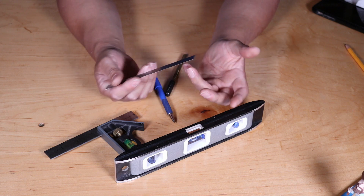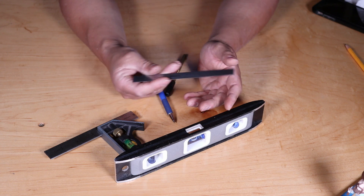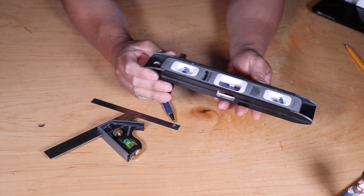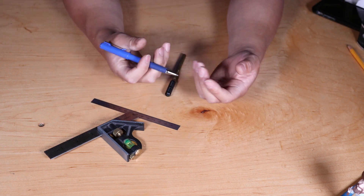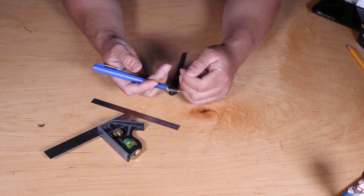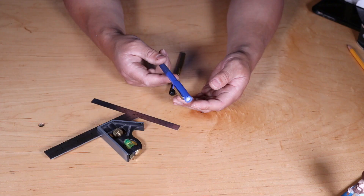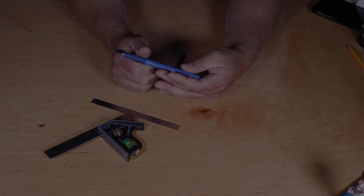It was a short video, but I hope you realize that you can level your lathe and take the twist out with the minimum tools. In this case it was this $10 construction level — again, that part was not necessary, but I just chose to do it. And all you really needed was that fixture that I made with the string and a plumb bob. Hopefully this video takes the mystery out of it and you don't get discouraged because you don't have that $600 level. Get yourself some confidence to go and check your lathe. Thank you for watching.